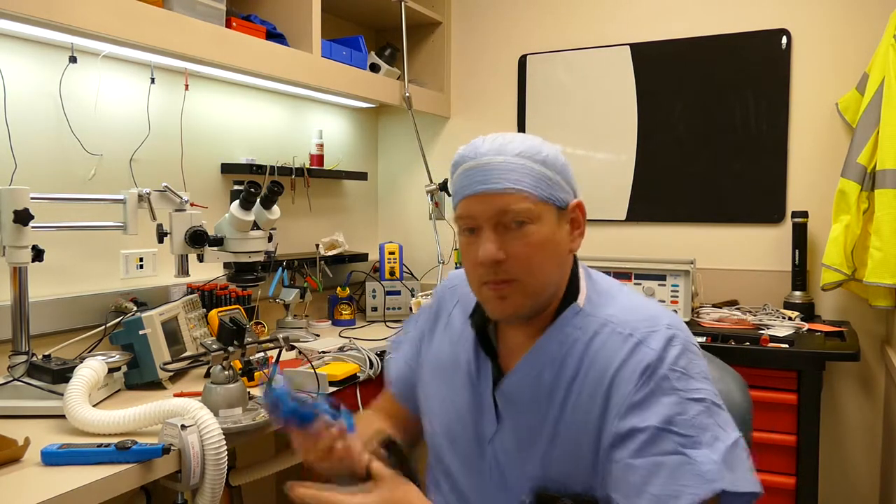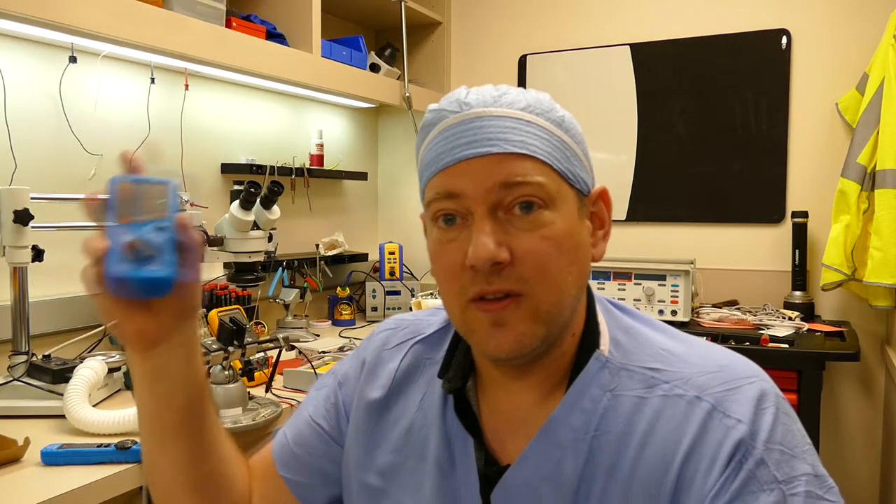That's just a quick pro tip for you guys — use a cable tracer. Almost every shop I've been to has one of these, and if not, they should. Usually these cable tracers are used by network engineers to trace a wire from the port to the comm closet, but I use them for finding breaks. It sends an oscillating tone down the wire, and when the oscillating tone stops, that's when you've found your break.